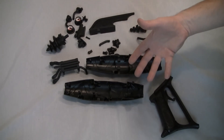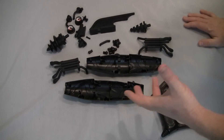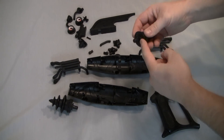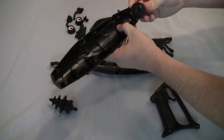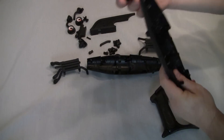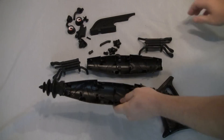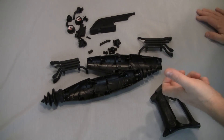To get the heat in there I needed a gap. These front and rear pieces were physically locked in there. You can see there's kind of an eccentric — so when it was rotating, it was actually rotating the keyed slot piece that wasn't really meant to rotate. The front actually has a square, so you can't accidentally interchange them. I can see that being beneficial in the factory, but for us it doesn't matter. That's why the front didn't really turn that well — the rear did.